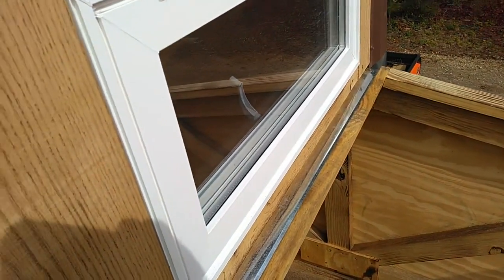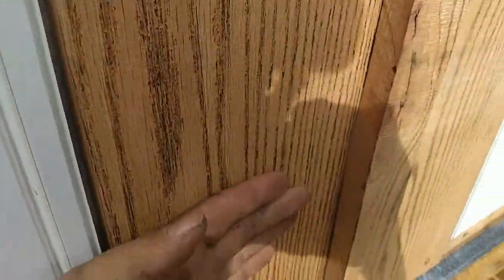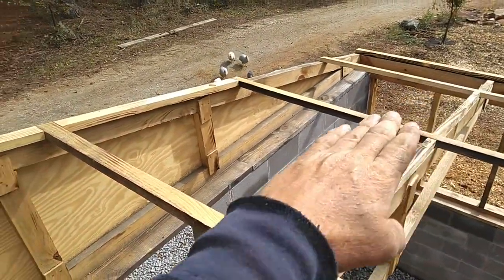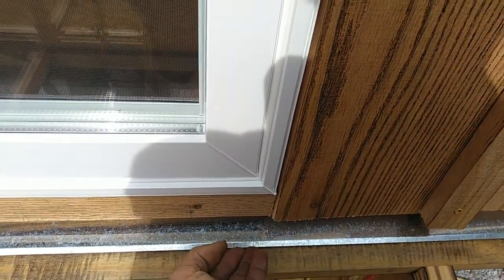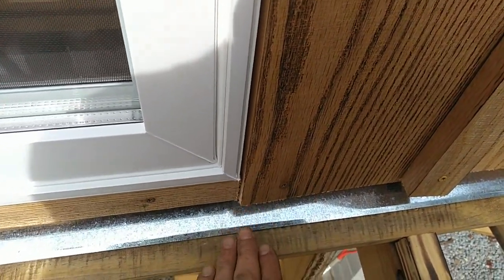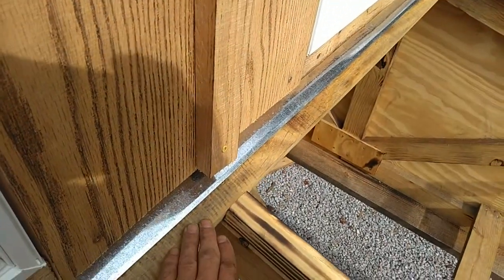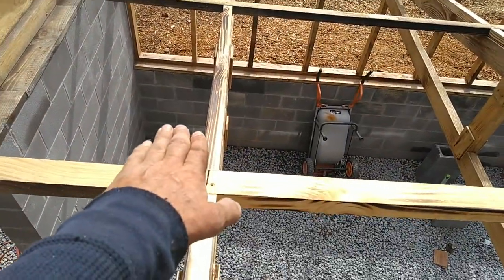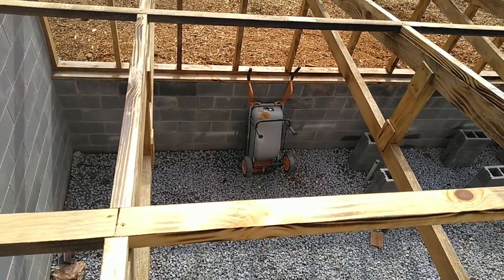Because of COVID, and I'm not really sure I could have done it any other way, I did the north wall, roof, and this wall first. I don't think I can come from this way up and overlap on top. So what I did was put a drip edge here — it's really not a drip edge, I don't know what you call it — but I've got a piece of metal to come over so that water can't go back. I'm going to raise it up so I can stick the Solex underneath it, screw it down, and each roll I'll have to stick it underneath the bottom piece.